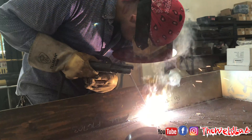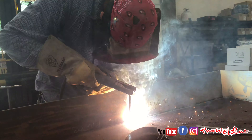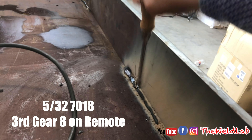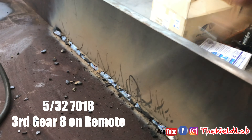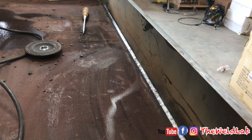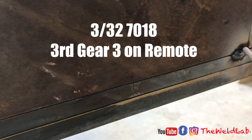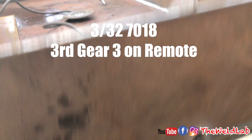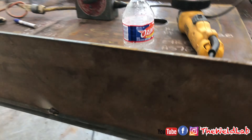This is what I got welding today. Using 5/32 for the outside, I'm just using 3/32, dragging the rod straight across, making sure I catch the top and bottom. You can do circles, but dragging it straight across will still come out nice and beautiful. You'll have a nice stringer in there, and that's all you really need for it to hold.